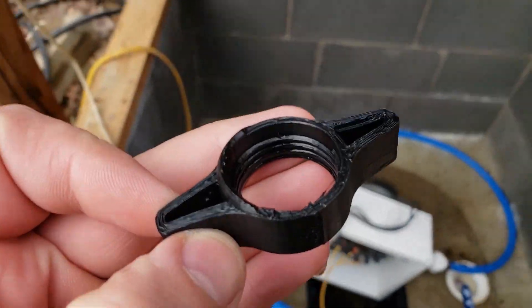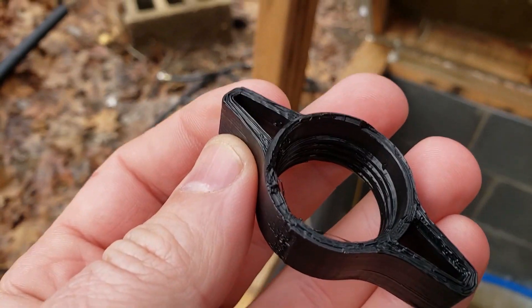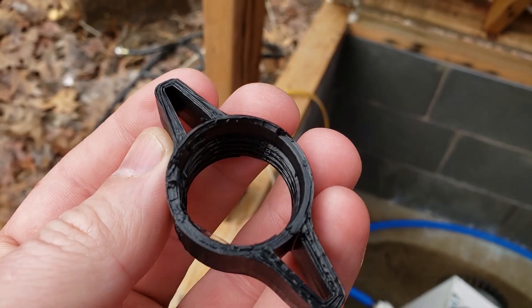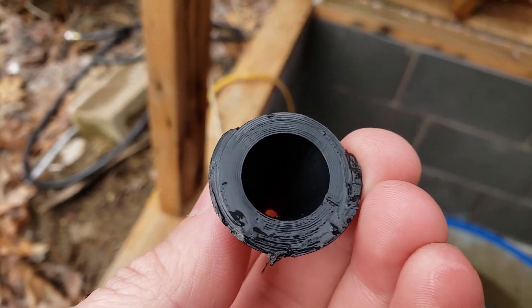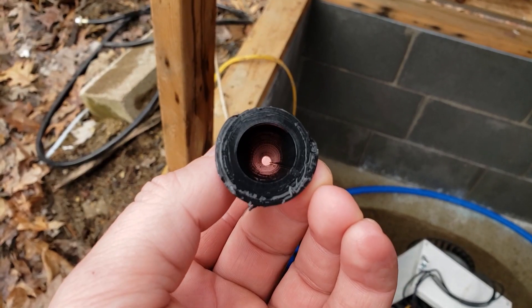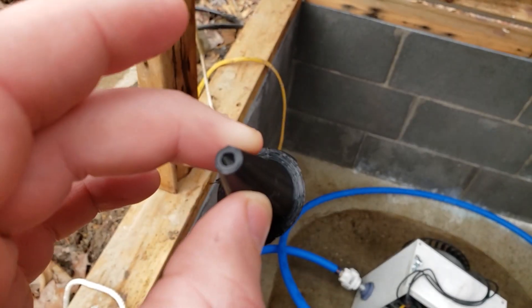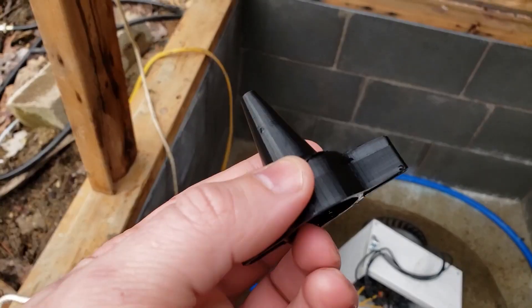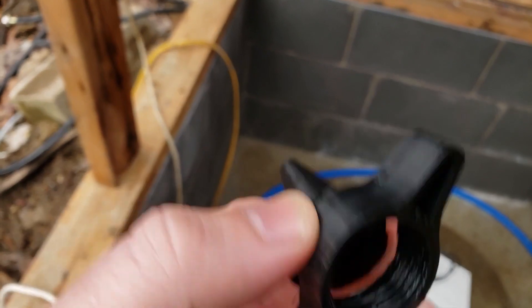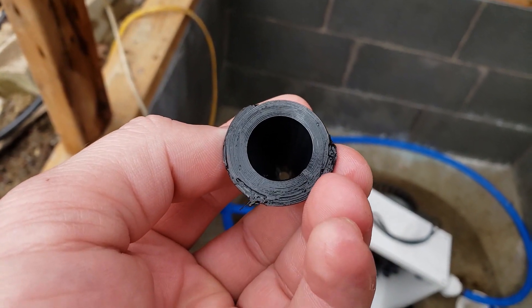Here's the nozzle that I 3D printed out of PETG. It's not really a failure at layer lines — I mean, it sort of is, most 3D prints do fail at layer lines, but not completely. So it's pretty good bonding. You can see it's actually kind of shiny in there too. I did drill out the tip with a tapered drill bit a little bit. If I do this again, I just know I need to increase the thickness of the wall there, and maybe add a radius at the bottom because I think it may have failed where the flat surface met the threads — and that's what is called a stress riser with a sharp corner.